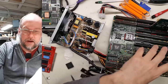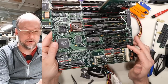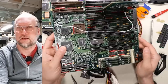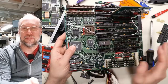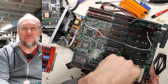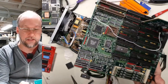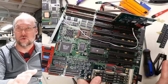Things aren't going so well. I did take out and replace the IC I thought might be bad—the one with the corrosion. I tested it outside the motherboard and it worked fine in the tester using the MiniPro. I tried a different chip and it didn't make a difference. You might notice the BIOS has been replaced and the power supply is open—because once I took that chip out and powered up the motherboard, it wasn't doing anything on the POST card and wasn't executing any code.